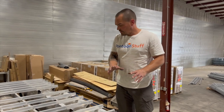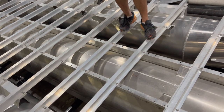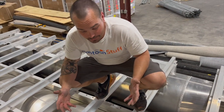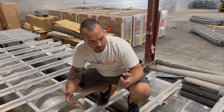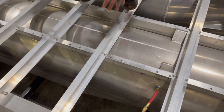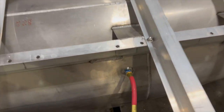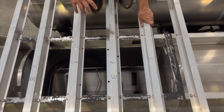Corey and I went through and tightened all of the bolts — every single cross member got two three-eighths-inch bolts with nylock and a washer on the bottom side. We knew this center pontoon had some damage — it's why we got it for $1,500. Somebody hit a rock; it ripped open at a weld but had been fixed. I put about 4.5 pounds of pressure in — usually somewhere between 3 and 5. It's a really beefy pontoon so we added a little more. I sprayed soap on where it was welded before and everything looks airtight.